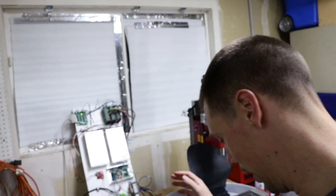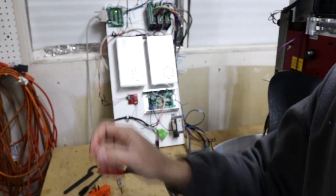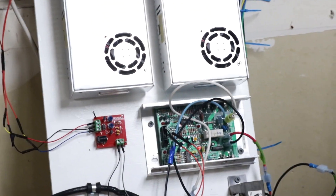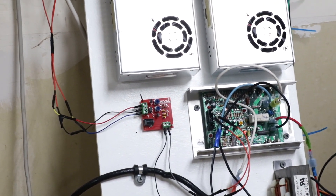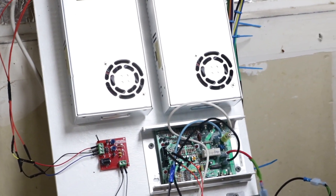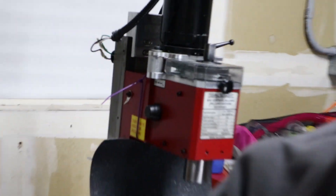I run my PWM-to-analog voltage converter for my spindle — those are for sale on rivalmachining.com, but I actually sold out of the power supply. So I don't have a power supply to turn the spindle on right now. What I'm going to do is use an M code to turn the spindle on in software — it'll show as on in Linux CNC — then try and crash it and see if the crash shuts the spindle off. I think it should.